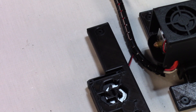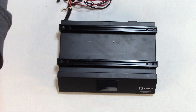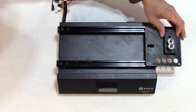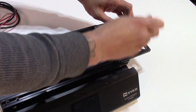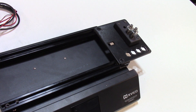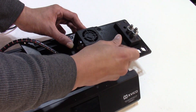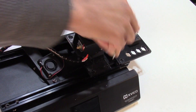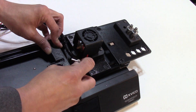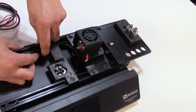Step 12A: Complete the rest of the build. With the bottle cutter mounted along with the head and blower fan, these parts can now be mounted onto the base frame, the two 2020 rails. Attach the cutter plate towards the right side of the frame, setting the screws and T-nuts in place on the right side using size 2 hex tool. Attach the heater block plate with 1 inch between the cutter plate, setting the four screws and T-nuts in place on the 2020 using size 2 hex tool. Attach the cooler fan plate 1.25 inches from the heater block plate, setting two screws and T-nuts in place using size 2 hex tool. Run the wire array cable along the back 2020 rail, tucking it inside the rail, and follow the rail until you reach the hole in the base.